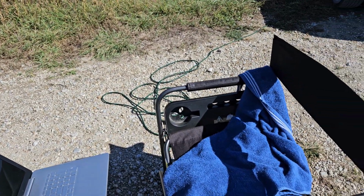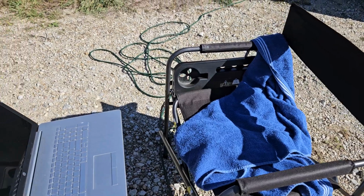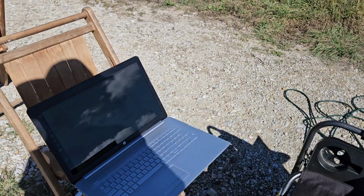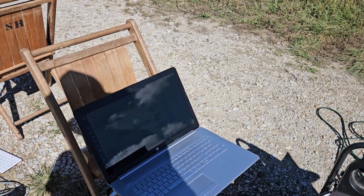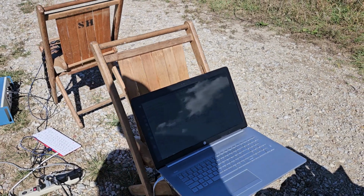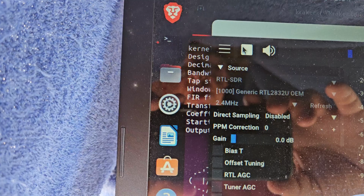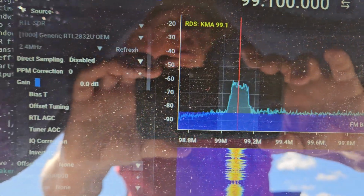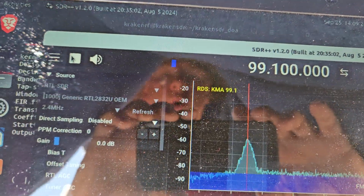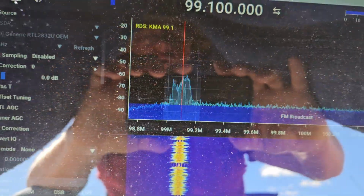I should probably point out that I take the measurements sitting in this chair. I don't start the measurements until I'm sitting in the chair with the shade over my head and over the screen so I can read what's going on. I sit there and read out until the histogram shows that the peak is at something like 300 samples, with whatever kind of narrow spread, and it is usually a narrow spread, of the phase differences between the two channels. And it's worth pointing out that even with the gain at 0 dB, the signal that's coming in is pretty substantial at negative 60, which one would hope is enough to provide the phase detection system with discrimination.